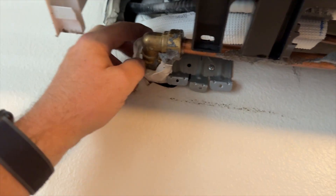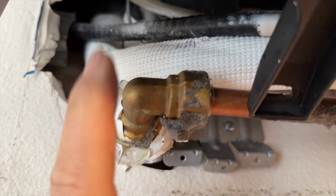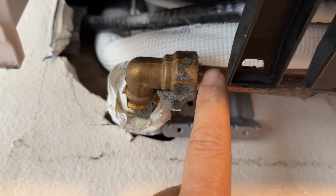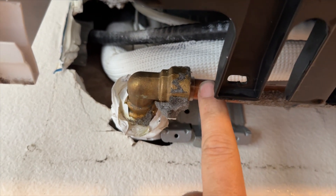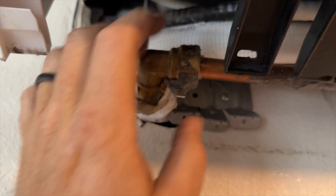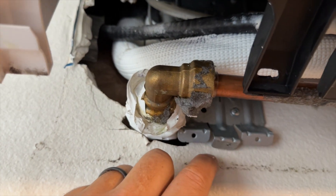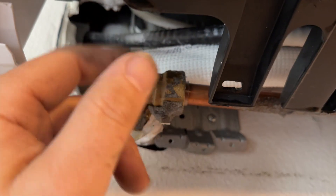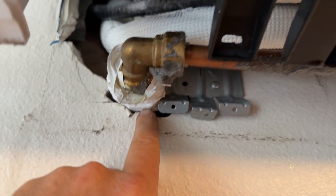I think this is the first time I've been able to show you the stupidity I'm dealing with. We have these press fittings — it needs to be a perfect circle on the pipe in order for this to seal properly, which it's not, because it's soft drawn copper. Also, you need to deburr it, which they're not — they probably didn't even sand it like you're supposed to.